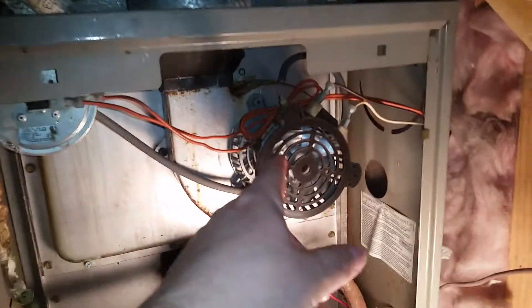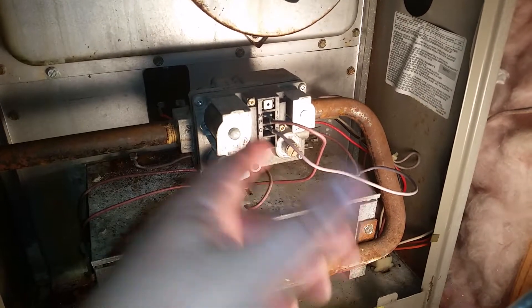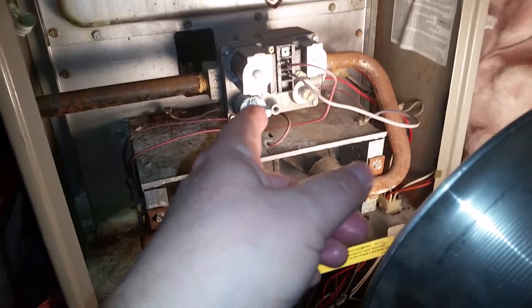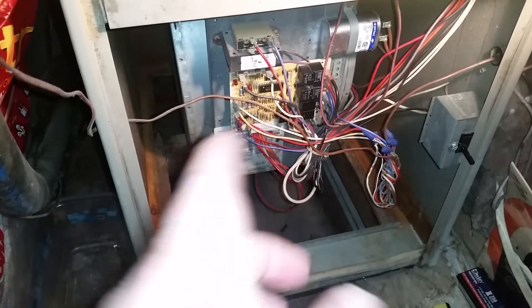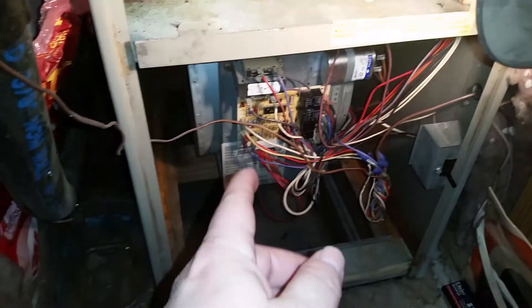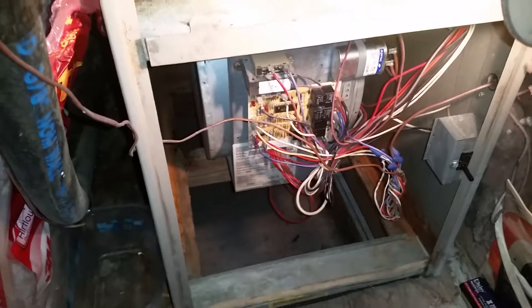I did try the heater — this came on and appeared to be working, but I never did get a glow over here. And the fan never came on for the heater, which makes sense because this would have to come on first, and then after it vented. When I ran the AC, everything would start up, the line would get hot, the compressor on the outside does run, the fan for the compressor outside runs, and the squirrel cage started to turn — and then it would just shut off after two or three seconds of running.